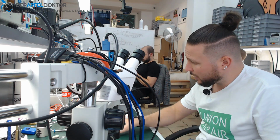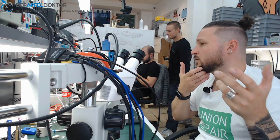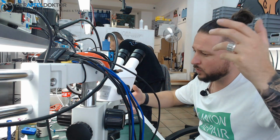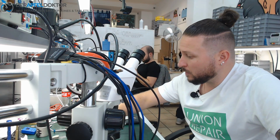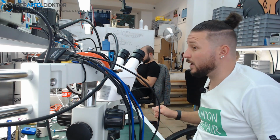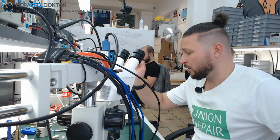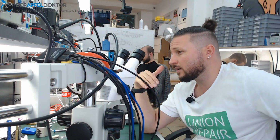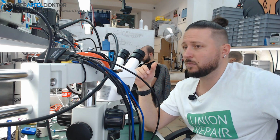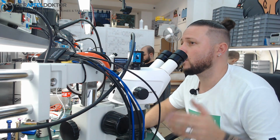Okay, it's not like on the iPhone 7 or 7 Plus, when you start the device and you get about 1.4, 1.5, 1.6, 1.7 amps, then you directly know you normally have a problem with 3V0 NAND. On the iPhone X it's completely different. For the values on the power supply you have to check that. Write down your values so you know. I know that when I get this value jumping down and going up on the power supply, I have a short on a line. Not on the main line, but on a line like 1V8 IO or 3V0 NAND or 1V1, things like that.